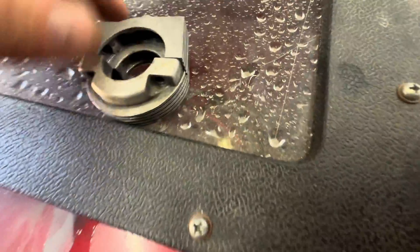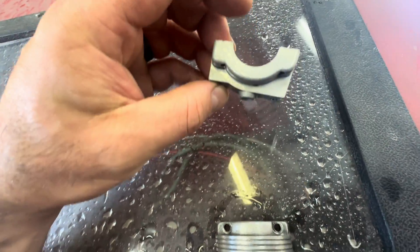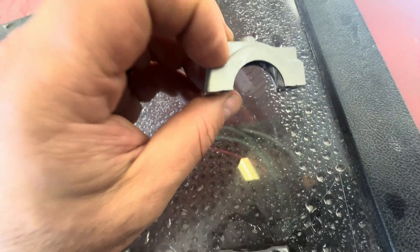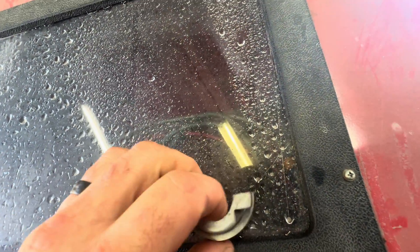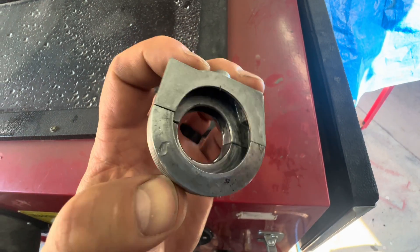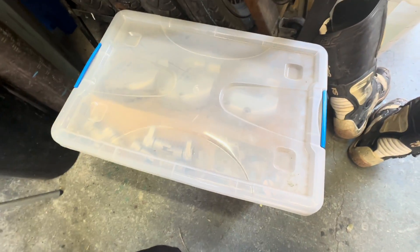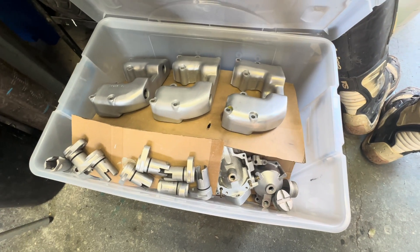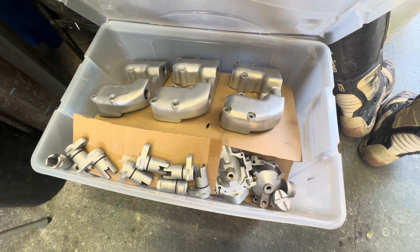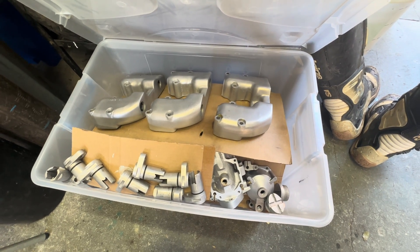So there's the finish difference between the two halves. The blasted part just seems to have a very satin finish. It depends on the metal - this is Diecast something or other - but it's a lot cleaner and smoother, so I'll take that as a win. I've got an entire tub full of parts blasted in the last few days - rocker covers, engine parts, carby parts and all sorts of stuff. I'm pretty happy with the results this thing's getting me. If you've got any questions, drop them in the comments, or hopefully by the time this video goes up I might have written something on my website to explain all the stuff I used and how to build one. Cheers, thanks for watching.